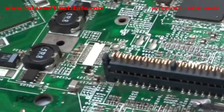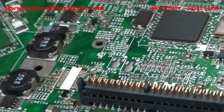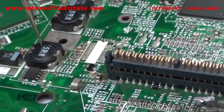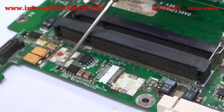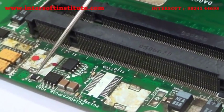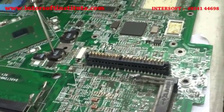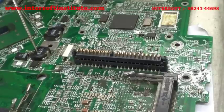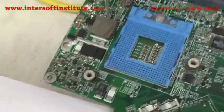We will remove this coil — see, it is an SMD. This is an inductor coil; these are the small coils, but their function is only for the power VCC. After switching the voltage, after the two MOSFETs, each section uses a coil — you can see the switching coil here. After the switching high and low through the two MOSFETs, a coil is compulsory in each section. In the VCC CPU section you can also see this coil.